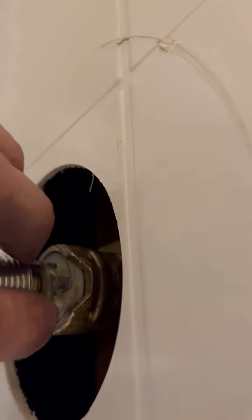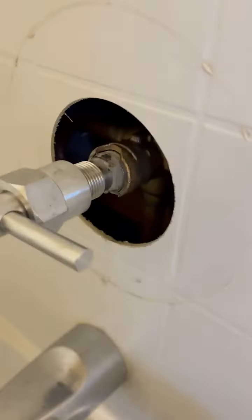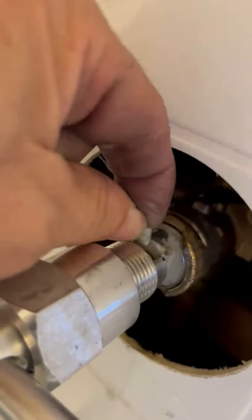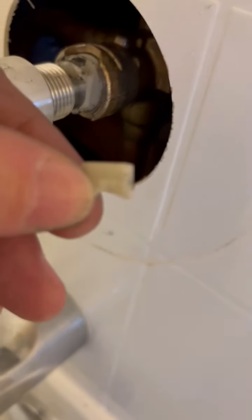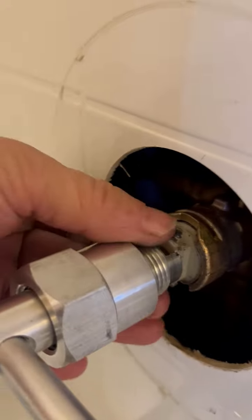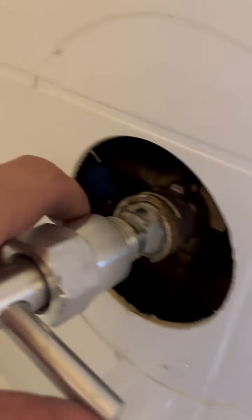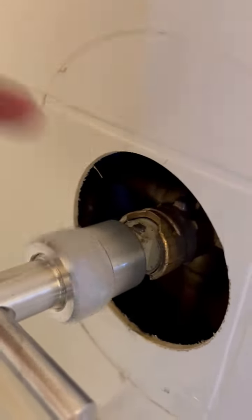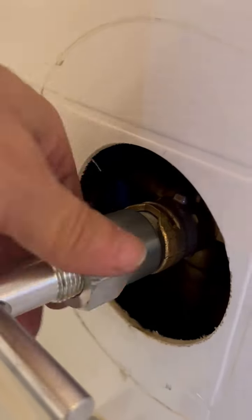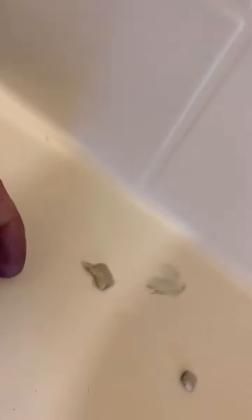This opening of the Danco tool is at the top, and these two side things butt up against this plastic here. What I found was the two white tabs that stick up right here are actually in your way and you've got to break them off, because it won't allow this thing to do its work — it's fighting against that tab. You're not going to use this again anyway, so just break off the one on top and on the bottom. Now you're firmly screwed on to the valve itself.